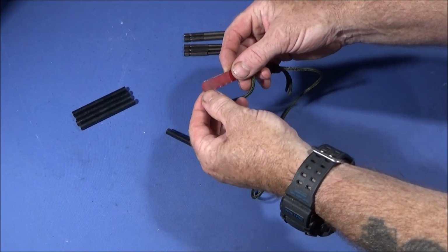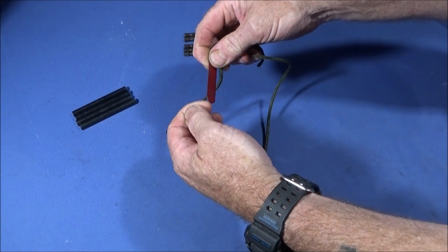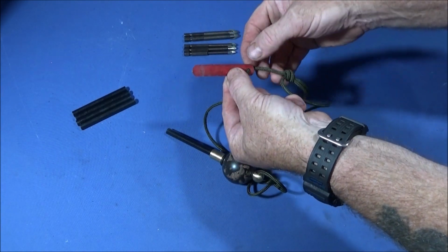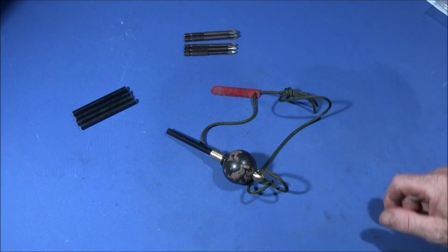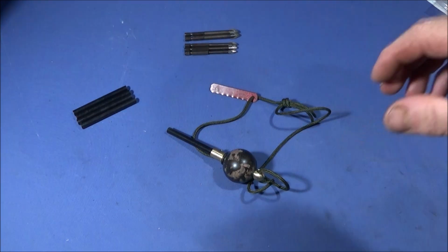So you just get a hacksaw blade and put it on the corner of the grinding wheel and grind a groove in it, break it off and just round it off. I always spray mine red. It has the hole in there, so you get 2 out of 1 hacksaw blade. So like I said, it's worth actually saving the old ones up in the workshop.